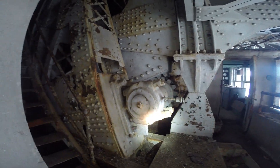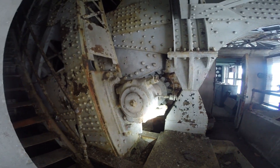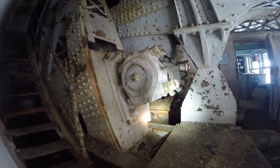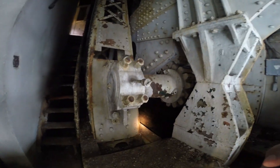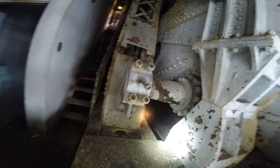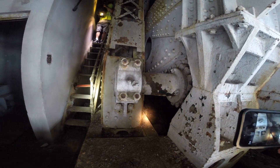It's all steel. All the water is going inside the column and it's filling up in there. The water gets in there, it doesn't go anywhere — it's corroding away. You can see how rusted it is; that's how much steel is left on the bottom of the column. The main reason this is the focal point is because of the runoff from above, from the curb. The cut between the curb and the road is letting a lot of water in.